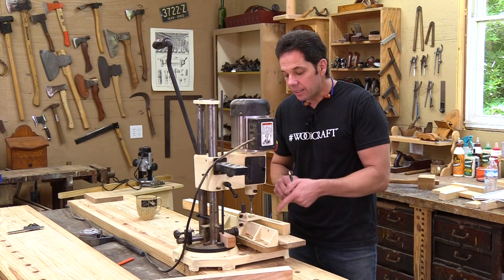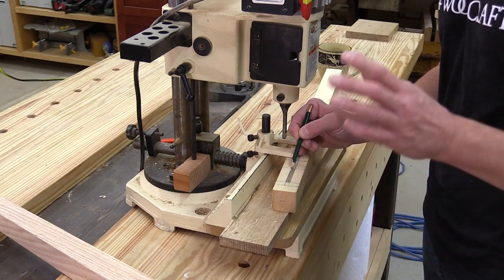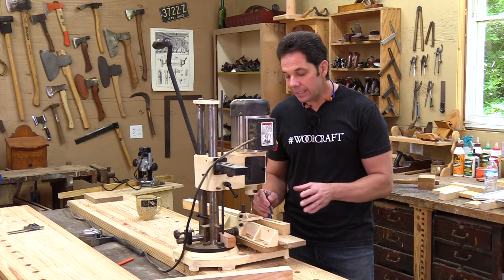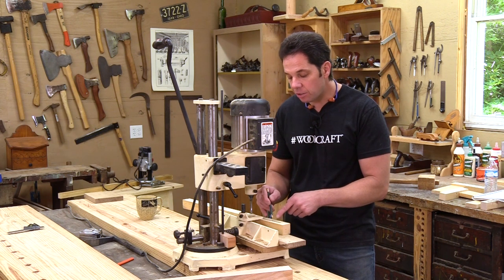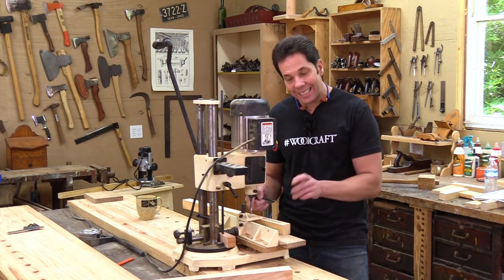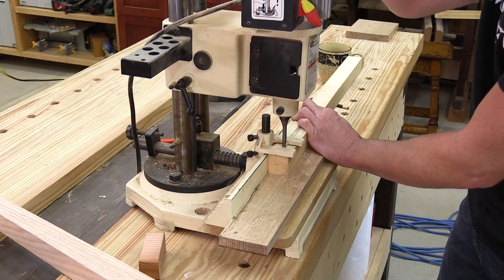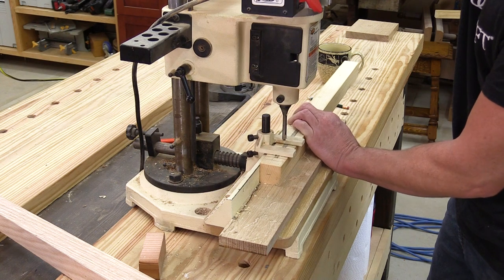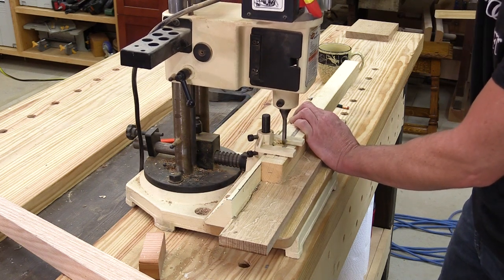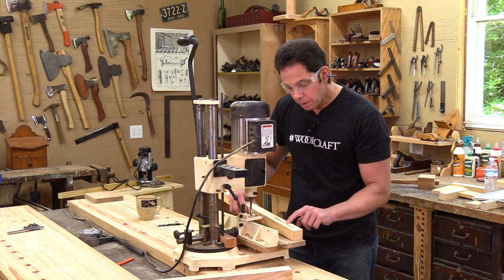Let me explain the series and how I make these mortise holes. I'm first going to start with the start and stop of where the mortise will be, and then move over and take another series of holes. I'm going to be skipping over the space because if I just try and nibble away one hole at a time, I wind up putting stress on the mortising bit and it wants to go to the side. I'll do the same procedure down here, then reset the machine to make the more shallow mortise.